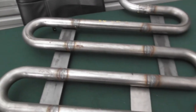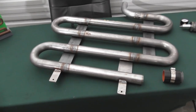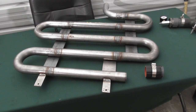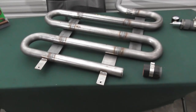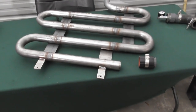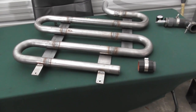So at this stage, once you have a completed welded assembly, you will have to leak test it. Now, I'm not calling this a critical, I'm calling this a non-critical assembly because, yes, while it does need leak tested, if there is a problem after the fact or it develops a leak after the fact, you can still come back in later on and fix it. There's no internal pieces that you don't have access to. But it does need to be leak tested, and it is significant.